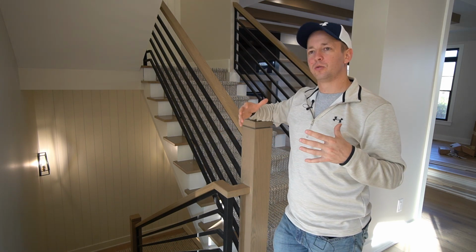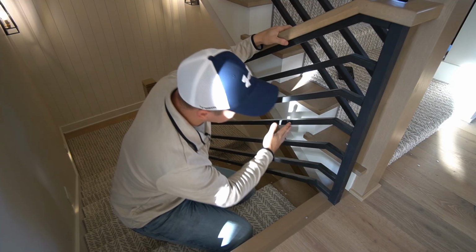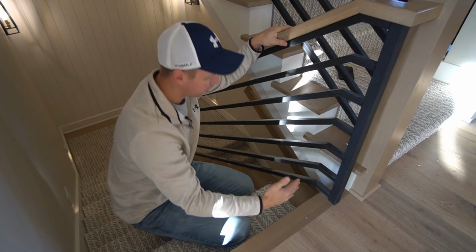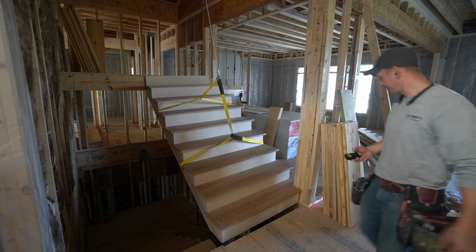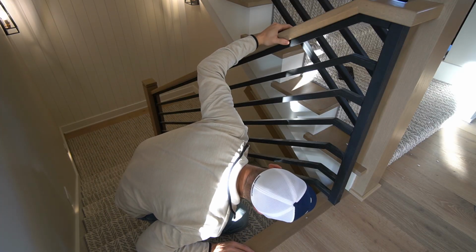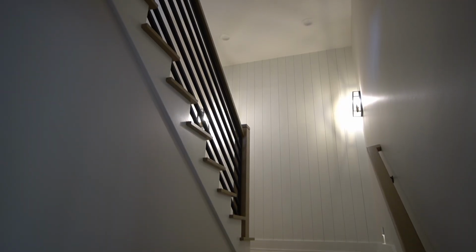And then the next thing was I needed to get framing underneath the stairs so it actually looked like it was supposed to. The other problem I had was, even though I was able to bring the staircase out far enough that the front of my riser was sitting on the subfloor, I had cut my skirt board here across on the flat. So it looked absolutely horrible. It didn't look right at all. So I actually scabbed on another piece of poplar, and the crazy thing is, I kid you not, you can see nothing right now of this triangle piece that I had to add on to that. No one would ever know if I wasn't confessing right now.